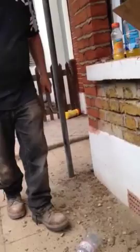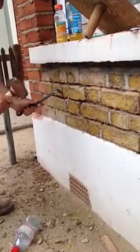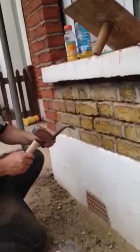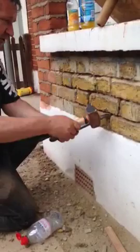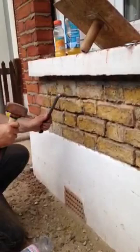As you can see, there's very little damage done to that brickwork. You will get a little bit of damage. This was very badly pointed to begin with. It has gone over the brick, which is what is causing a little bit of damage on it. Wrong gauge. Too heavily pointed. Should be done in a lime mortar. As you can see, that's solid.